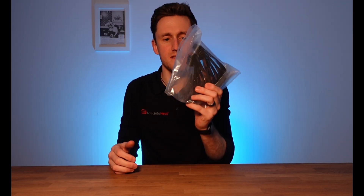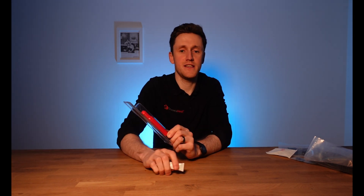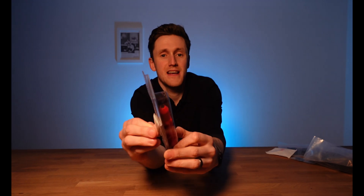When you receive your thermoskirt order you'll also get a spares kit included in your overall package. In the spares kit you get around 10 extra wall mounting brackets, some spare O-rings in case you damage any during installation, and five additional stainless steel retaining clips — though if you find you need more than expected, double check the instructions, as each individual kit comes with enough retaining clips for that assembly. You also get a sachet of grease to lube up all parts for insertion into the skirting, a deburring tool, and some cutting oil — pretty much everything including the specialist tools needed for the thermoskirt installation.